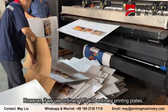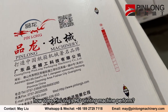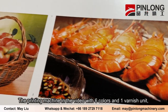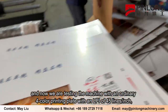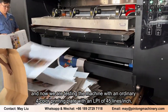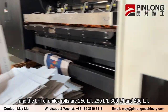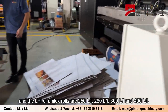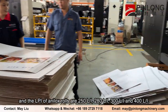However, if we use ordinary LPI and ordinary printing plates, how does Pinlong's HD printing machine perform? The printing machine in the video has six colors and one varnish unit, no slotting and die cutting. Now we are testing the machine with an ordinary four-color printing plate with an LPI of 45 lines per inch, and the LPI of Anilox rolls are 250 lines per inch, 280 lines per inch, 300 lines per inch, and 400 lines per inch.